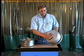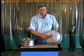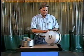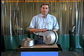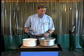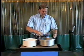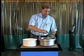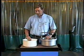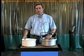Another thing we do at U.S. Centrifuge is the part of the bowl that actually sits down on top of the spindle is incorporated into the bowl bottom casting. It's also cut with a taper inside, and the spindle has a matching taper. This ensures added concentricity and smoother operation. We also take our aluminum bowls and hard anodize them for extra durability and corrosion resistance. One of the things that makes our machines really a lot easier to use is having the liner lifting tool and a removable liner — it simply clips on and you can remove the liner. Our liners come in two materials: a stainless steel liner or an ABS plastic liner. The ABS plastic liner works for a lot of applications, and if you damage it, it's less than $20 to replace.